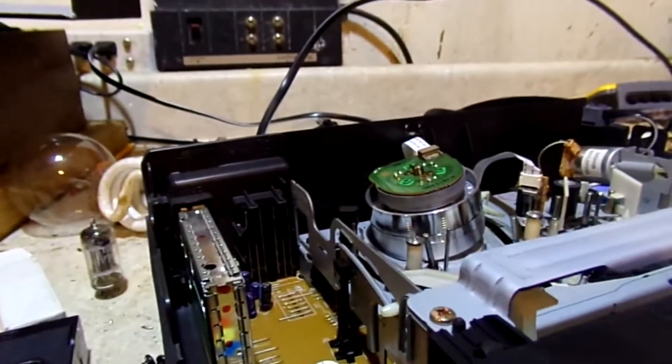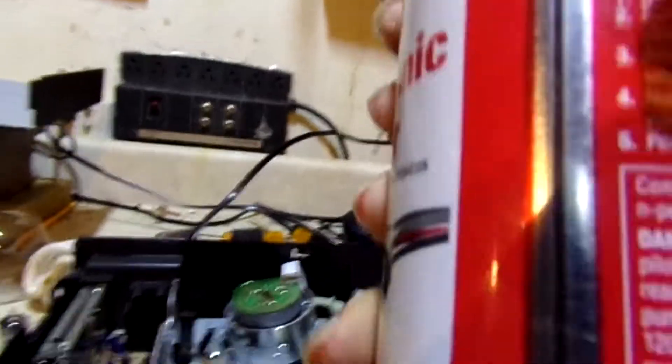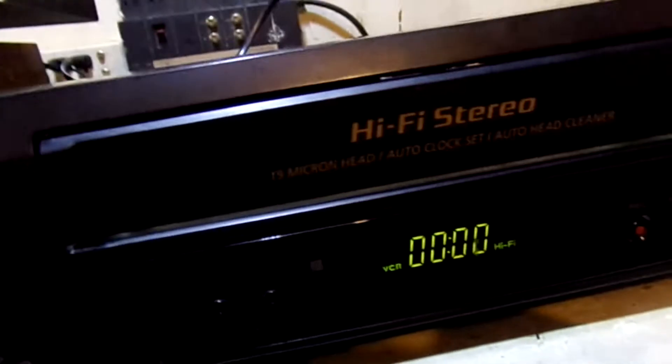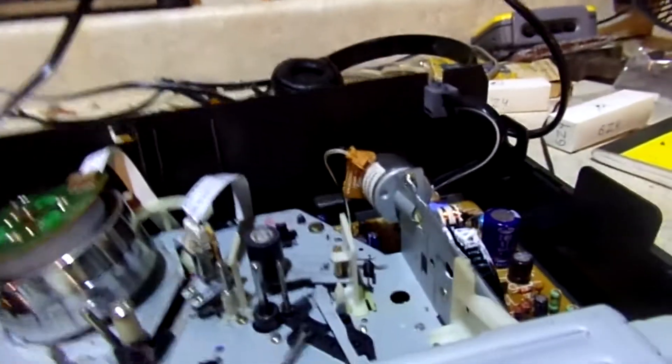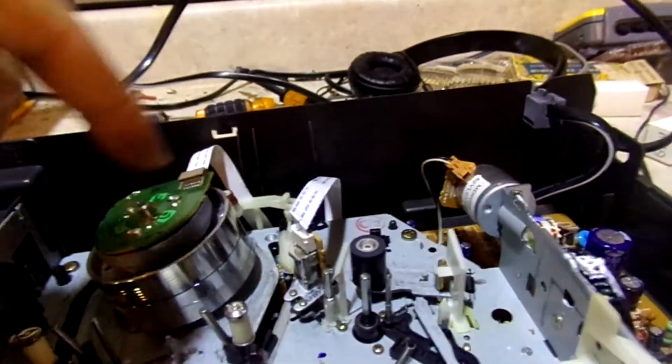Okay, put a little straw in the can. I did a handful of things off-camera: I put some grease in the mechanism, and I sprayed contact cleaner behind the eject button — and now it works fine. It was just a dirty contact all along. Nothing was wrong with the mechanics, but I re-greased it for good measure, putting some grease on the sides of the mechanism — just being careful not to get any on the playhead.